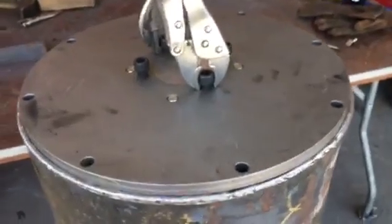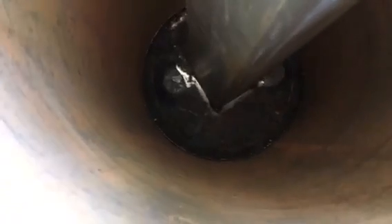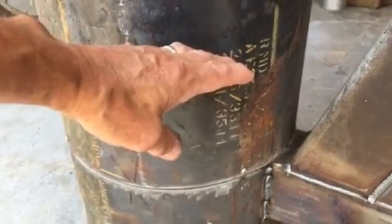I've yet to put my half-inch plate on the top of it. I did put a cavity in it — it comes all the way around. If you look you can see the ledge that's inside there that joins the outer casing. That is going to be filled with vermiculite. It's like a cavity that comes up to about right there, and it's going to cover the intake tube and the vent tube going up in the center of the stove about that far.